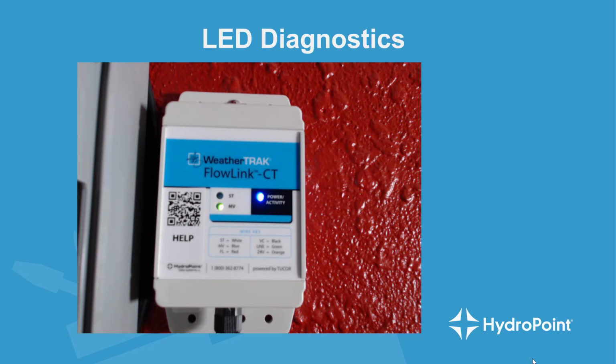And once you've validated your master valve activity light, the last CT LED diagnostic that you want to check is your station activity light. To do this, we turn on the station valve that we've connected to our EXT and make sure that the ST light, or station LED, comes on our CT.